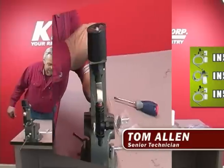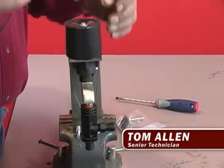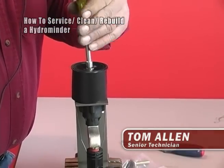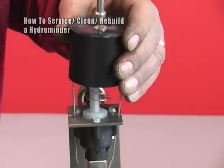To get started, the first thing we're going to do is remove the magnet cap. You can either use the quarter inch nut driver on this or a flathead screwdriver. Take the screw out and lift up on the cap.